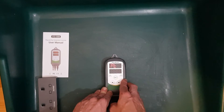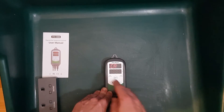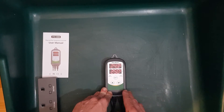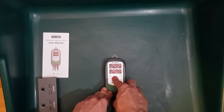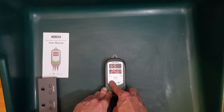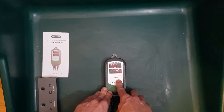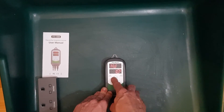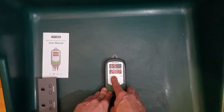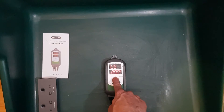PT is for any delay for compressors, which we're not using. CA is for calibration - if you have any known variants in the temperature probe and any temperature devices you're already using. We didn't actually get to complete that because I was talking too much, so we're going to set it to 28 again. Leave the differential down to 1. No compressor, no calibration known. Setting temperature as in Celsius or Fahrenheit, then to save we hold the set button for 3 seconds.